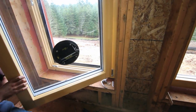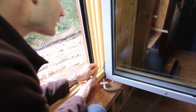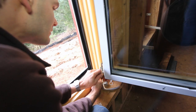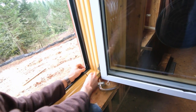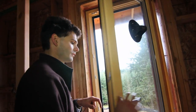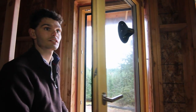The sideways adjustment in the hinge is found here at the bottom. Always do only two to three quarter-turn adjustments prior to checking again where you are and how the window functions. This made it better, but it's not perfect yet, so we'll go sideways at the top as well.